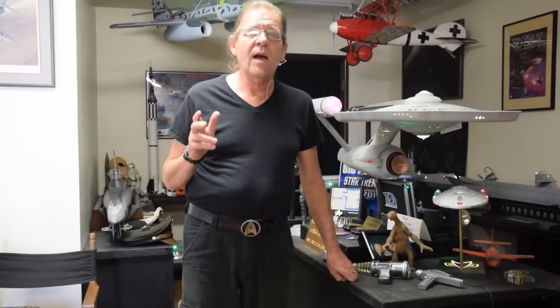In addition to that, the D finally gets finished so it can be shipped back to China. This time it's going to get shipped in a different manner, so we hope it gets there just fine. I'm sure it will. Also, the communion bust has been rather popular lately, and the mold's starting to wear out. So I'm going to show you how a clay press is done. Basically, we want to make another sculpture, but we don't have to resculpt the whole thing. We want it to look like what we've been selling all along. So we're going to clay press the mold, pull a pressing out, tidy that up, and make a new mold on it. You're going to see that process.